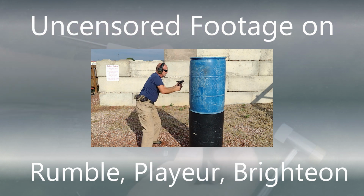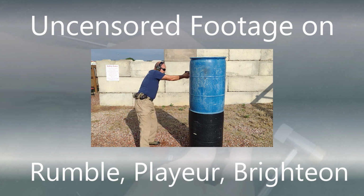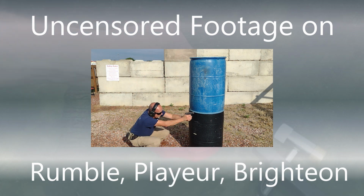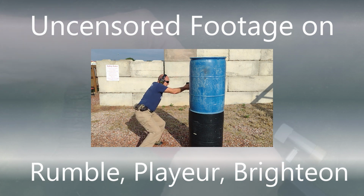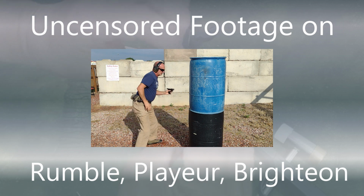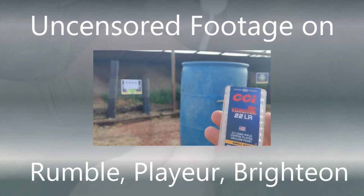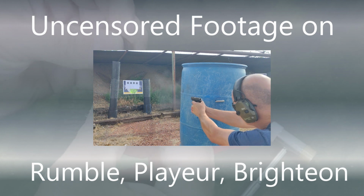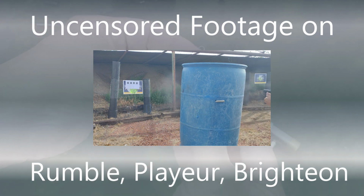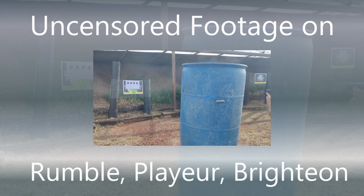Go ahead and do a controlled disassembly of the FCU to prevent the loss of parts. Key parts are slide stop arm and spring, trigger bar and spring, hammer safety, safety lever, disconnector, trigger pin, and trigger. Drive out the roll pin holding the mainspring to the hammer. Insert Galloway mainspring. Note that the bottom hook will be facing 180 degrees from the stock spring. Makes things a bit more challenging on final assembly.